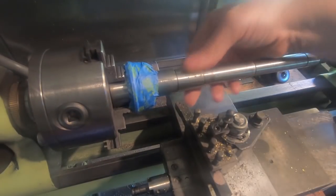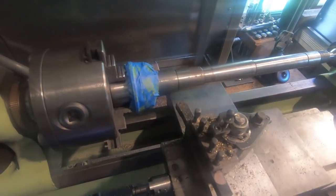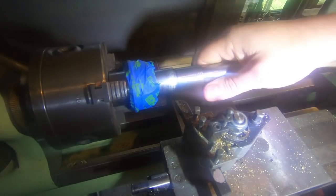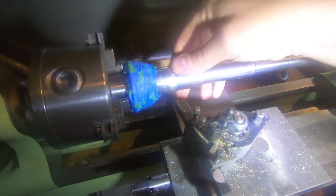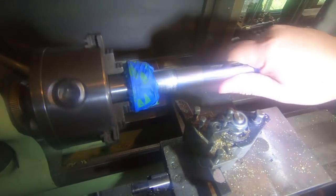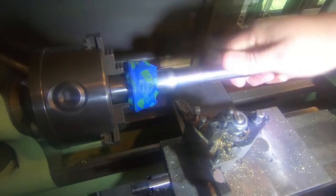You can see there's a bit of rust here, just oil marks really. There's a burr somewhere which means this little bush that slides on here won't run across properly, and the threads could do with a wire brush too. I'm going to go over that with a little bit of fine emery paper and clean that up so the tube slides on here without interruptions and the pulley slides on nicely.